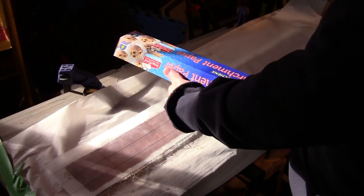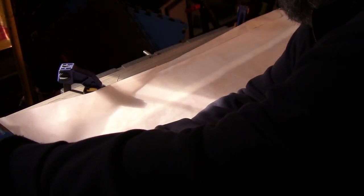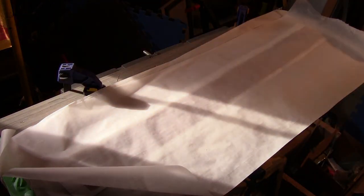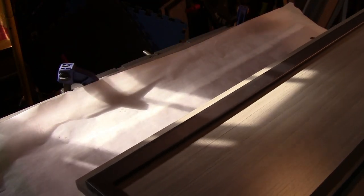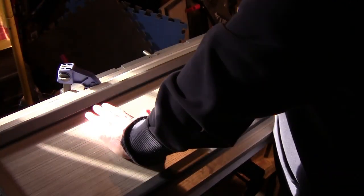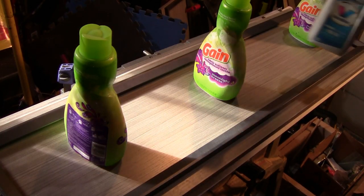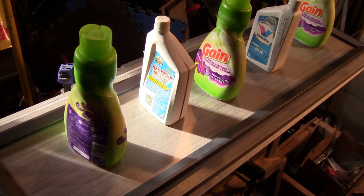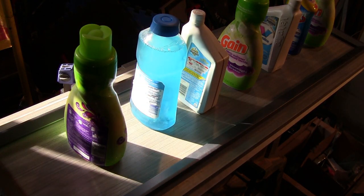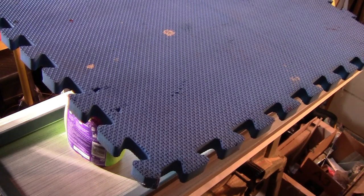Next I'll put down another layer of parchment paper. I'm going to sandwich all of these pieces together, and the parchment paper allows me to put another piece of wood on top without it sticking to the fiberglass. I've laid another shelf on top to create the sandwich and add a little pressure, plus some additional weight courtesy of my wife's cleaning closet and a couple of quarts of oil. Plus a little warm box to surround the fiberglass with some heat — I put a space heater nearby because it's really cold in the garage and the fiberglass doesn't want to cure without a little bit of heat.